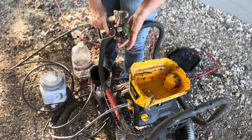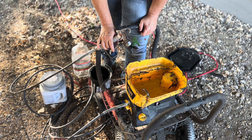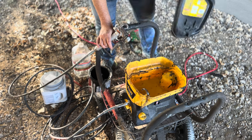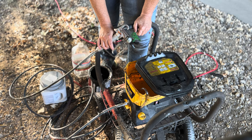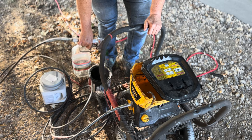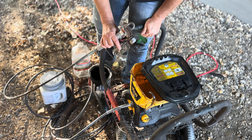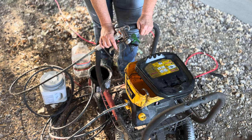It still wouldn't spray, even after I had used my air compressor to clean out what I thought was the clogged tip. And I was actually getting in the truck to go buy a new tip for my paint job here. And then I thought, well, let me just check this out. So I read a troubleshooting tip on the lid of this paint apparatus. And it said, if your tip clogs, turn it around backwards and spray into it, and sure enough, that cleared just by turning the tip around backwards where it shows the flow goes this way. And spraying, it cleared the tip for me way better than trying to use compressed air to blow it out. So I know it sounds silly, and I can't believe I thought that was the answer, but it seemed like the right thing to do.